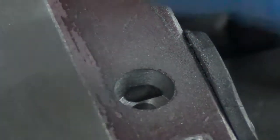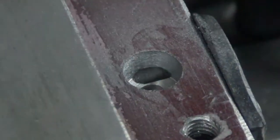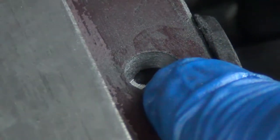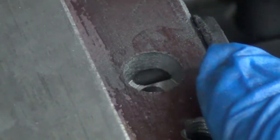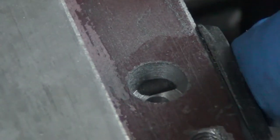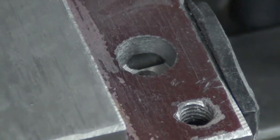Yeah, so I should have stopped at 200 thou. I went down the 100 thou and then decided, okay, this one has a bigger pocket. I can easily go down more because I knew that the thickness there was a whole lot greater. There's no V coming up to meet the hole. But, you know, that's the pocket for the screw there. So as long as the screw stays fairly sealed, it shouldn't drip too much oil. But I was hoping to have a bigger hole here so that I could basically have more oil reservoir. Oh well.